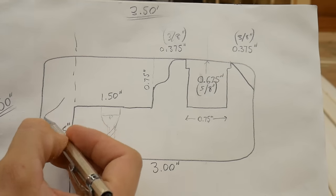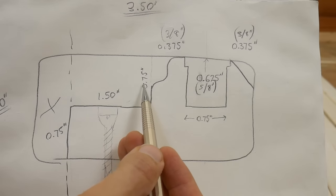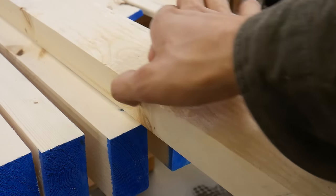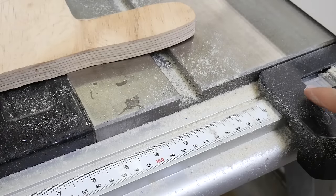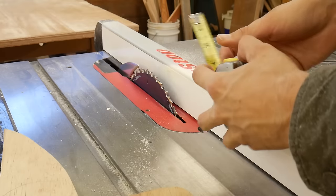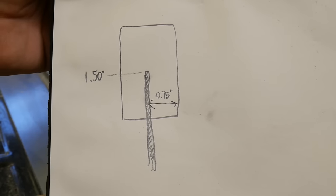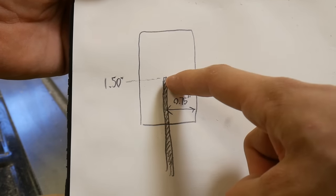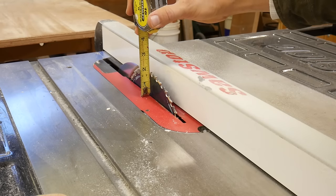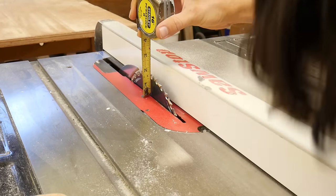Back to the drawing — we've managed to remove that chunk, and now we're going to cut out a rectangle that is about one and a half inches by three quarters of an inch. This is yet another opportunity to remove knots and imperfections. On this one, I need to cut to the outside of the blade to make sure I'm removing three quarters of an inch — so make sure your saw is off when you do this. I want the blade to go up one and a half inches and keep a full three quarters of an inch on the side. We'll make sure the blade height is exactly one and a half inches at the peak, and then we're ready to cut.